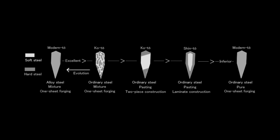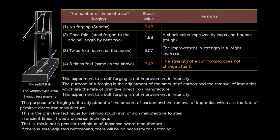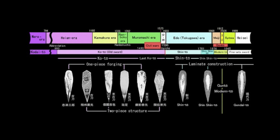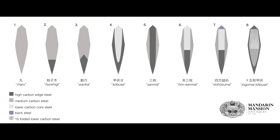High temperatures were not obtained in the Koto era Tatara iron mill. For this reason, pig iron, iron, and steel were made harmonious. Swordsmiths devised serious methods to make a good ground metal, called Jigane. Therefore, there is a difference in steel materials for every swordsmith and every school, and differences in the ability of a swordsmith arose. The beauty and excellent performance — pliant and strong — of a blade was realized by combining steel materials of different kinds.